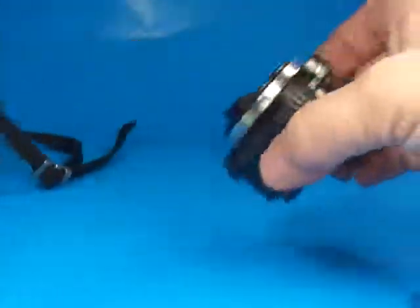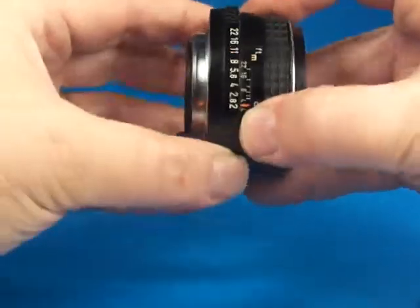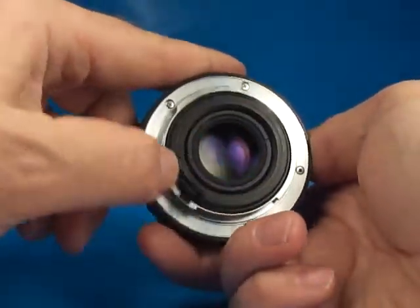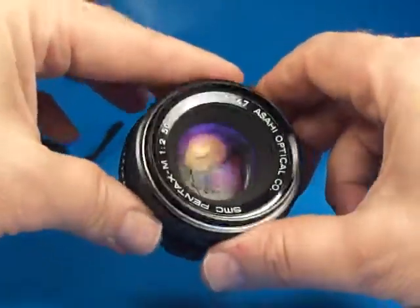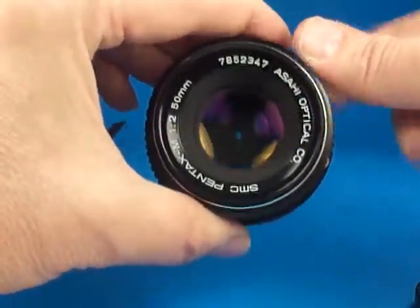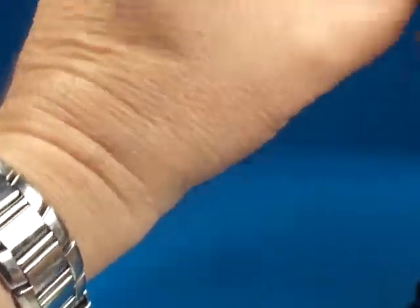And the lens — focus feels very nice and smooth. The aperture ring has nice clicks on all the settings. If we leave it stopped way down and look in from the back, I see no oil on the blades, and they're very quick. Looking through the front, they all come together nicely, and I don't see any oil on the blades. Looking toward the light, I do not see any big splotches of fungus or any problems like that. So it looks like a good lens.